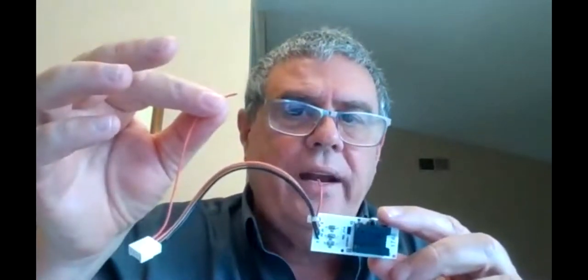Here's the last time a guy installed one of our openers. He used his needle nose pliers, accidentally got in between the wire and plugging in the battery lead, and when he squeezed it, he cut the wire. Didn't notice it because he wears glasses like I do, and our opener didn't work until we fastened the wire together. So these are some of the troubleshooting tips. I always recommend the guy open up the machine, make sure all the wires are connected properly, and look for things like boards that are dangling from where they belong.